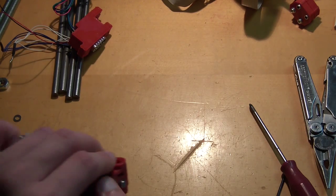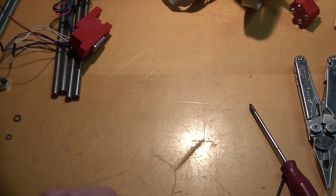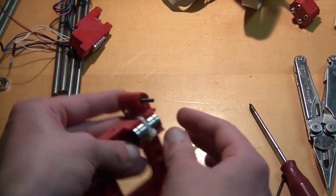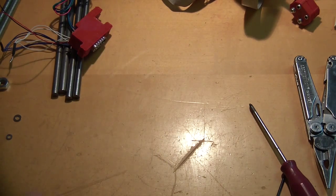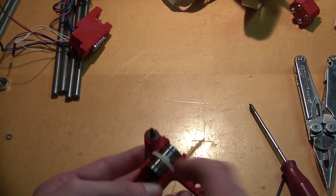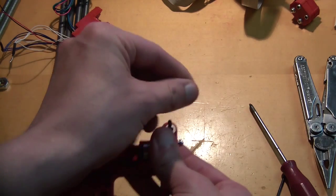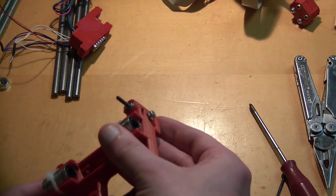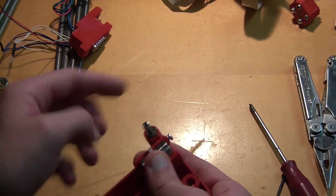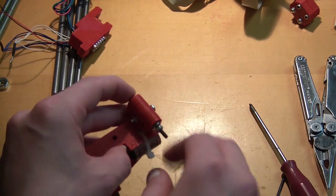So you put it in here and then you take a long screw with another nut trap on the lower side. The problem is I didn't have the right screw, so I had to do it a little bit differently. Normally you just put a nut in there and then you just screw it — it's a really straightforward process. What I had to do is put an M4 washer to cover up the nut trap, and after the nut trap is covered I just put a normal M3 washer and screw it in place. That was because the thread didn't extend all the way down there. But if you have all the right screws, you can just screw it in there. I'm using a normal nut right now — you want to use a nylon nut later on, but that's just to hold it in place.